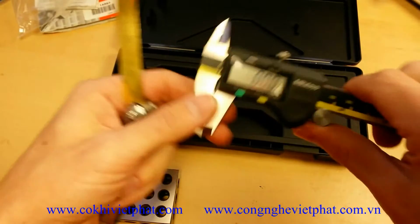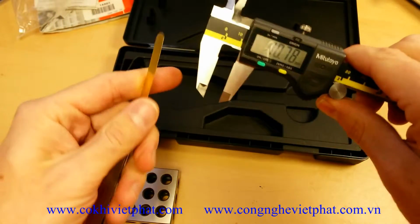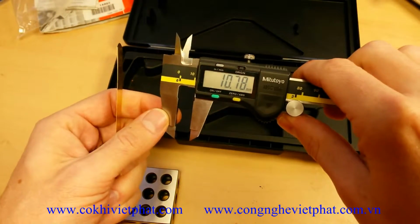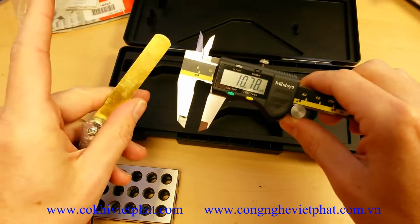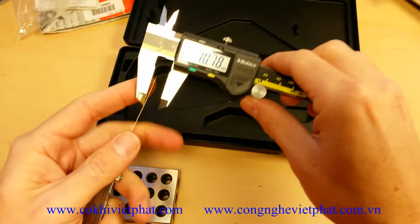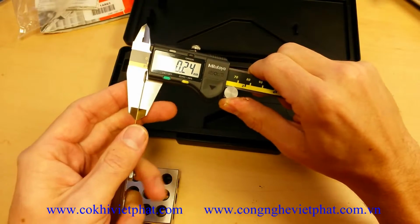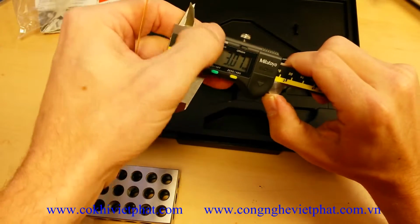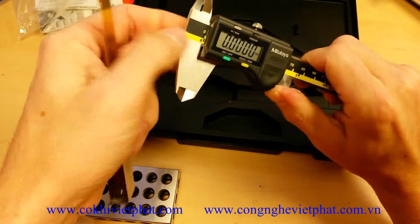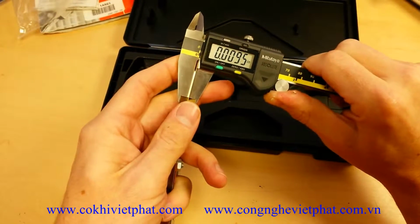Let's show you some of the tolerance values here. I noticed a big discrepancy in actual rated accuracy and tolerance, especially on the cheaper Chinese ones. This is a 10 thousandths feeler gauge here. We're going to go ahead and measure it at full depth. And I'm going to switch it over to inches. It does not have fractional measurement.